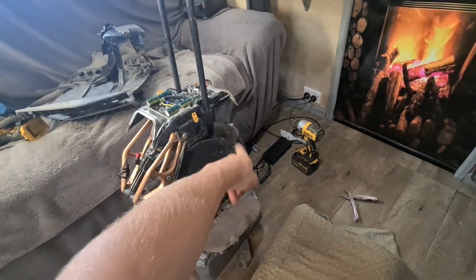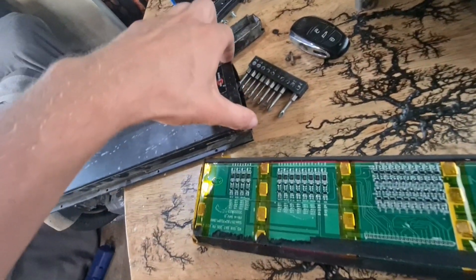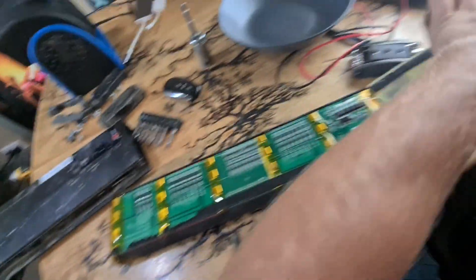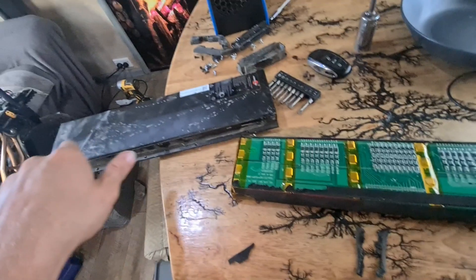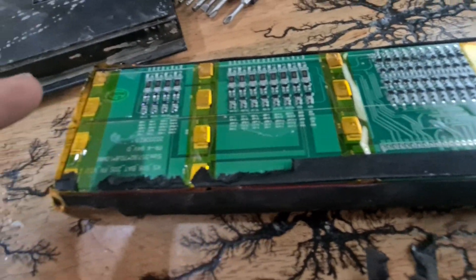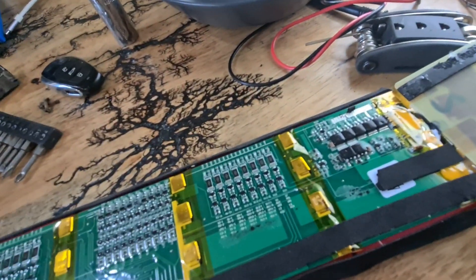So if anyone's ever curious — S18 — I had to rip off the battery. It's right here. You take off the screws at the top. It's four screws at the bottom, push it through, the bottom pops out the top. And then there's this little cover covering the BMS. It is a massive BMS — look at the size of that thing. It's the whole length of the board. Now you have to figure out which one of my cells is dodgy and charge it up, and hopefully I'll be all good again.